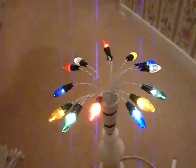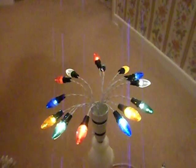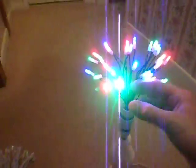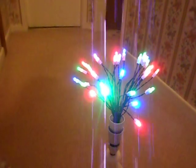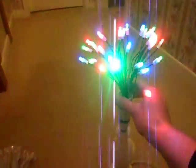Then I thought, what else can I make? I got some LED olive lamps, hacked them, and put Molex connectors inside — you can pop these caps open and change the LEDs. I found that warm white and all of them together gave a really nice retro look: all sort of sepia and pastel-y, really attractive. The power consumption of all these strings I've just plugged in is around one watt or less. Then I got a bit greedier — these lens lights splatter light all over the wall, whereas the other ones use side-emitting LEDs. I just like the side-emitting LEDs; they're visible from a wider angle. Again, you can just change them to whatever LEDs you want.